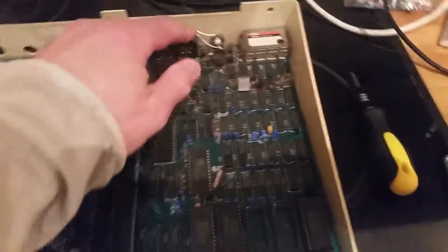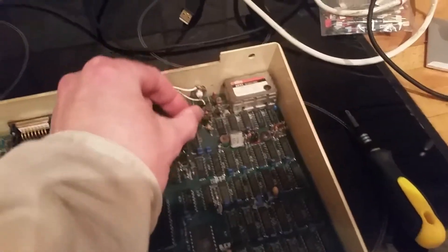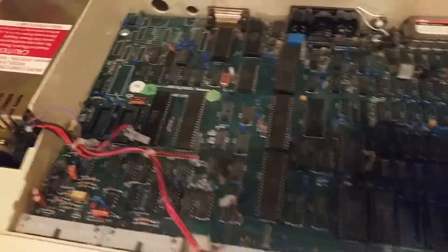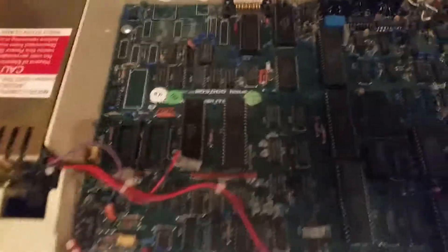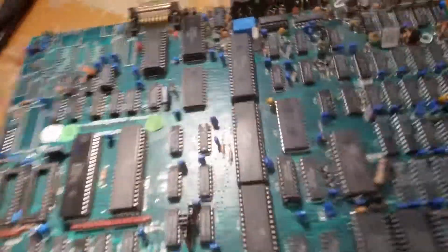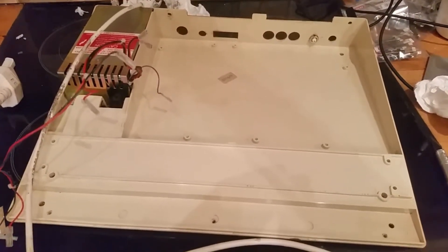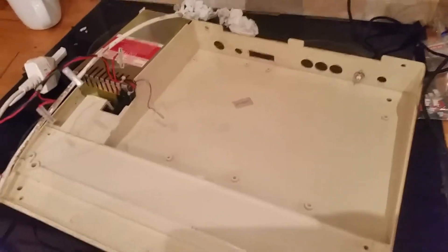But before powering up I'm just going to desolder this - I've marked which one's the centre pin, a bit of tape so I know what I'm doing - then desolder that, take the board out. And while the iron's on might as well swap these six caps. Very easy. Board recapped - still pretty tidy underneath, it's all good. So the only things are this modulator is rusted to hell - I'm going to use a composite out. And these are rusted to hell. I'm going to give it a blast with some cleaning stuff and then put it back together.